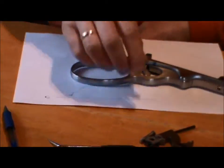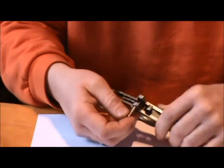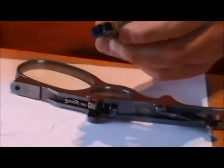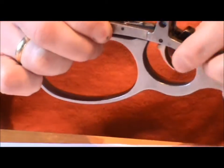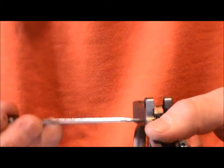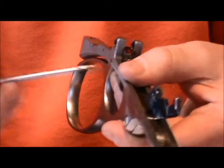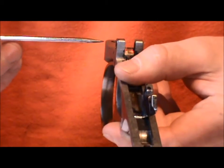Here in the receiver, the screw is very sloppy. For the trigger - very sloppy. In the hammer - very sloppy. This is sloppy. If you are going to tighten something up, we don't know the relationship between these two holes - if they are angled one way or the other. If you knew they were parallel you could tighten up the trigger and hammer holes, but we don't know that. Let's assume we don't know.